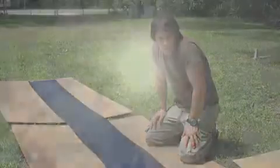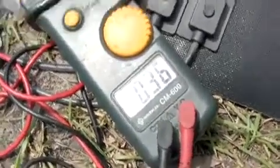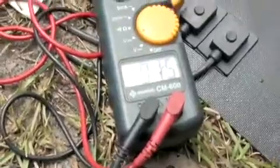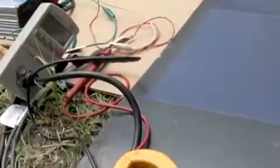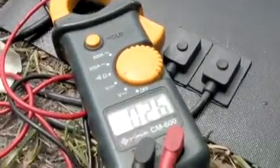I ran some tests with it. One of the tricks to get an inverter like this going with a panel that produces 42 open volts — because this inverter doesn't go that high and faults out — is to cover it temporarily. This drops the voltage into a working range, and then you remove the cover once it gets going, though sometimes it faults back out. You really need an inverter that can handle the higher voltage.